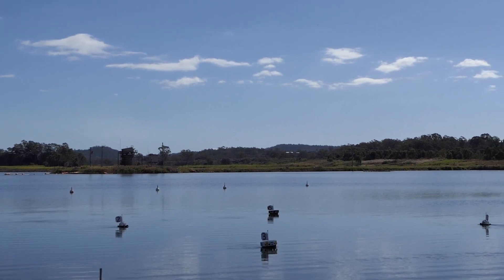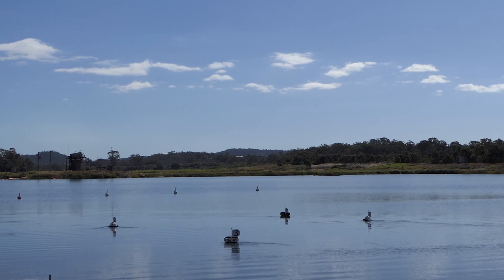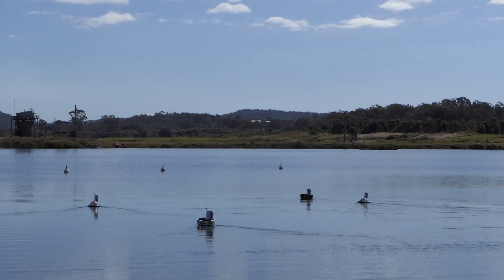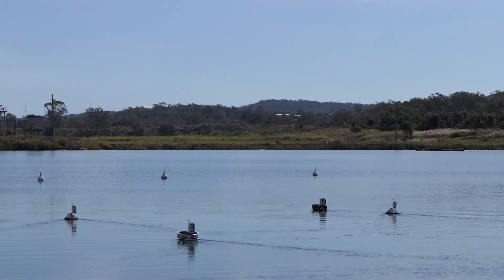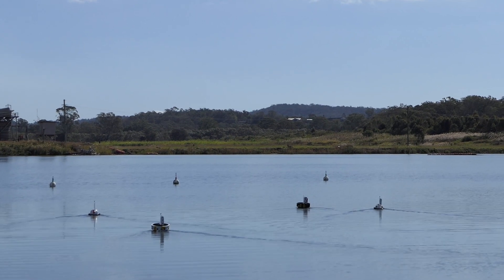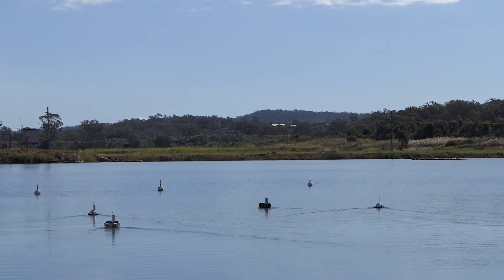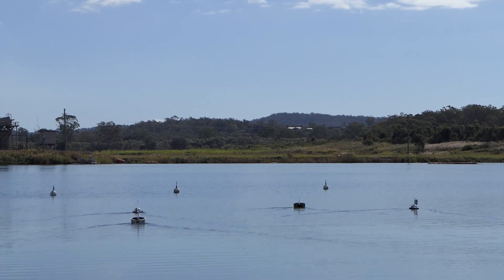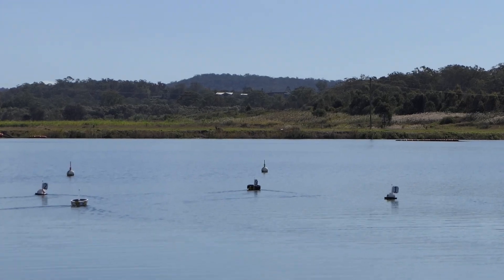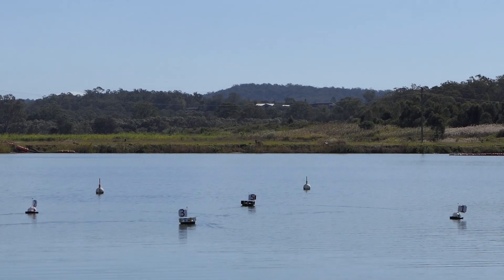I hit trundle until I get an audible signal, and now they're all going to follow number one in the same geometry as before, but realigned 12 meters to the northwest. When they reach position, I'll get a message saying number one is anchored and you'll see it visually. We've still got 15 meters to go, but we can interrupt and say we've overestimated — so I'm going to anchor number one where it is. The others will keep moving until they're in their relative positions. And there — number five stops — they've all pulled up.